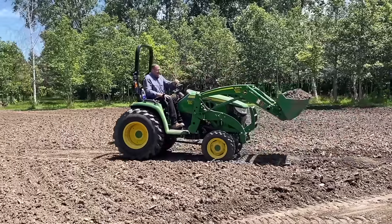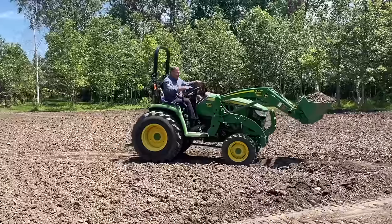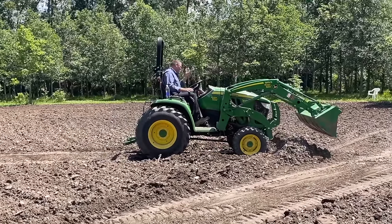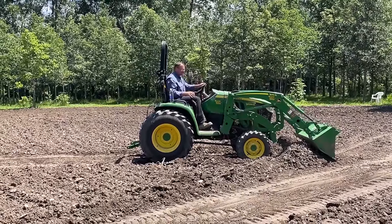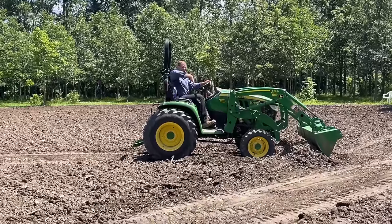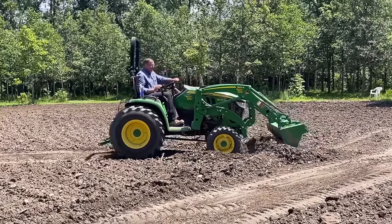So sometimes you gotta fill some holes or otherwise try to help yourself get to a level surface. I mentioned earlier, one of the things you can do is go pick up some dirt or push it in front of you would be even better. But then let's say I've got some holes here I'm trying to fill. I wanna build a little pile, and then get like this. But the key is I'm kinda flat right now because I just made a semi-flat surface for myself. So now I can get in there. The bucket works better to back drag when you're like this, as far as pulling a big pile. If you're just trying to smooth, I'll show you that after this, but I got a big pile to move.